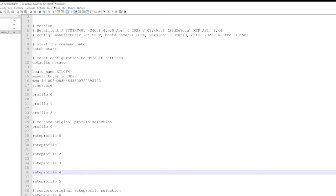When we go to flash this flight controller, we're going to need to know the board name. If you mistakenly flash with the wrong board name — also called the target — the original target information is lost and it can be difficult to recover. So if you're dealing with a bind-and-fly quadcopter that came pre-configured, you definitely should back up before updating firmware. Even with a completely blank flight controller, you should still back up. It's a good habit any time you flash a flight controller.